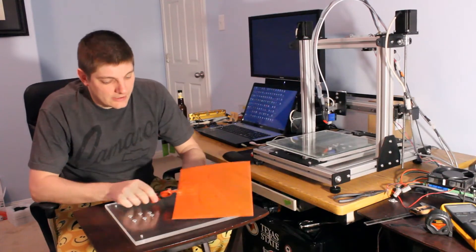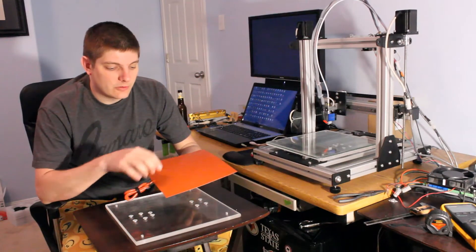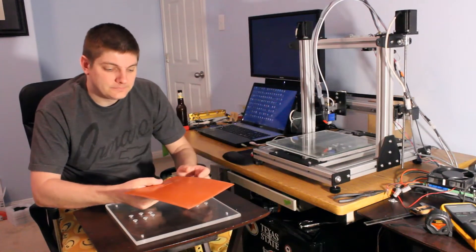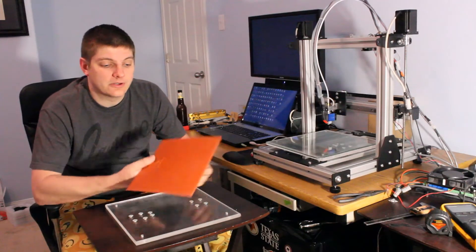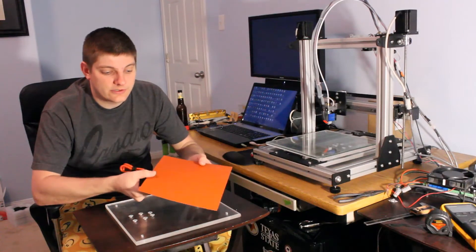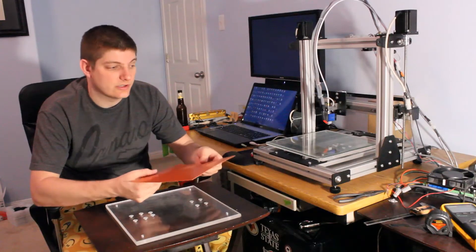So I noticed online - this is the one from Cubed - it was a pretty good bed and the price was right, it was like $20. So this is made for 24 volt I want to say, so I'm a little worried this might be the thing that makes me go for 24 volt. If you remember from my other videos, 24 volt on this thing makes quite a bit of stepper noise that I can tune out if I change the voltage down to 12 or somewhere in between. But 12 is probably what I'm going to go with. This will do a certain amount of wattage - I want to say it's 300 watts on 24 volts, so I'll get half of that on 12 volts. And if that's too slow or if I can't make the temperature I want, then I can luckily power it separately and still get control with the board.